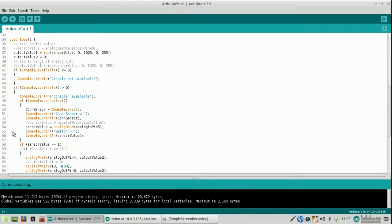So now this is one thing, and now I have to change this, because digital is either 1 or 0, but analog isn't. And since this is now analog, which is probably between a value of 0 and 1024, I would say that if sensor value is 1, will change to larger than or equal to 512.